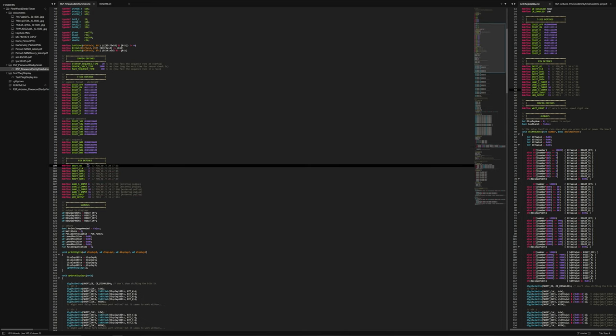And this is where I actually struggled a bit, because when I programmed for my Arduino Nano, it worked out great. I could just say D2 and D5 and that kind of thing, these digital pins in the Arduino space. But as I went to the Nano Every, nothing was working. After a bunch of digging around and some trial and error, I figured out that these pin numbers worked out. So just pin 1 through pin 13. And this is honestly just kind of hard information to find. I had to dig through the header files that came with it. But anyways, we got that dealt with, and that's good.